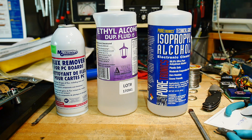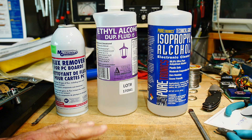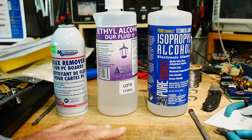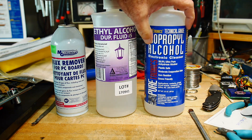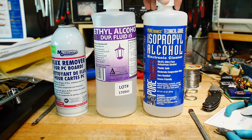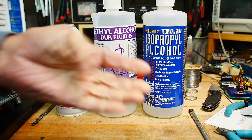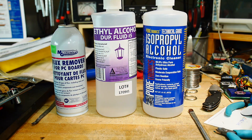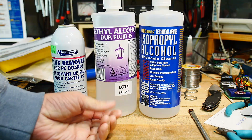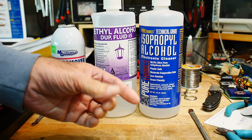Here's a tip I found. When I was first working at one of my early jobs, the laboratory had access to ethyl alcohol. Most laboratories have access to isopropyl alcohol — IPA — and I use isopropyl alcohol all the time here in the garage, including to clean rosin flux off of PC boards. I've always found that isopropyl alcohol doesn't clean the board very well — there's always a residue left over that's sticky and hard to get rid of.